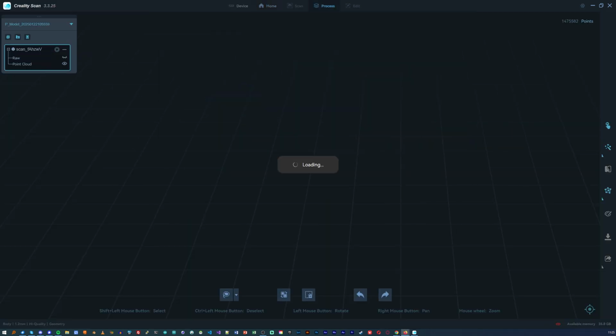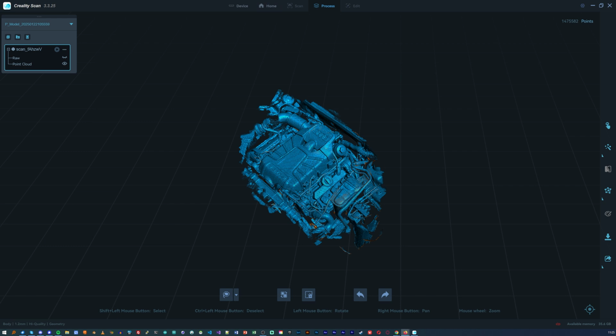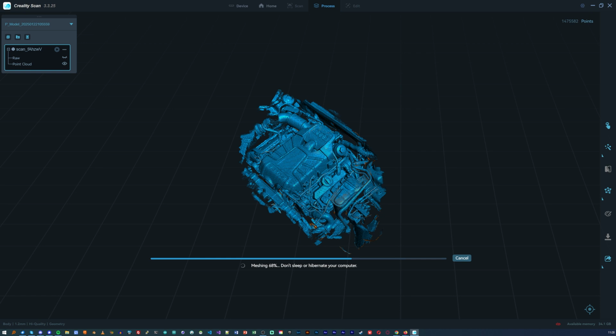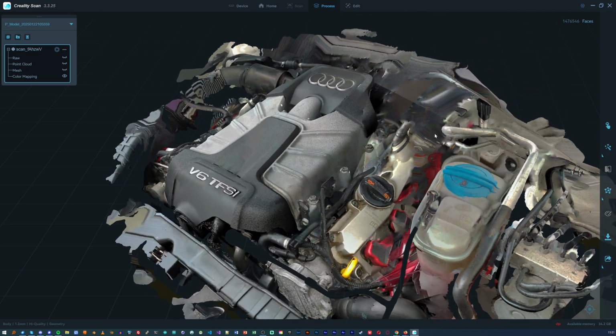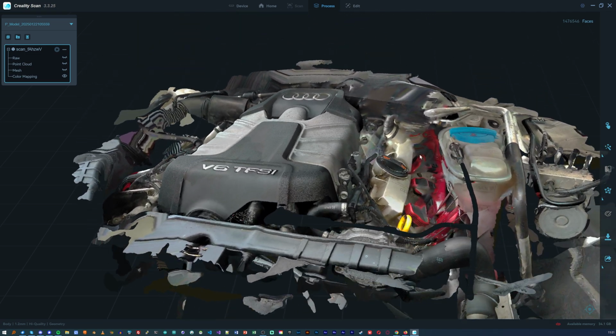I had to do that for my engine, and that's where I ran into a few other issues with the sort of meshing process. Because the scan isn't whole, as in I didn't scan all the sides of my engine to create a more complete mesh, what I ended up seeing was close to a mostly flat plane with some texture to it. The option to close holes and create a shelled body, well, it just really didn't know what to do with this, especially with the bulkhead up at the back as well, which meant that it ended up inverting half of my coils and valve covers.